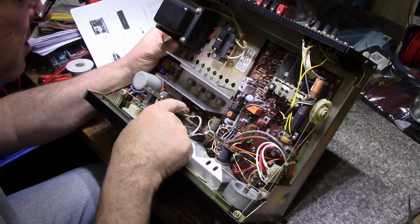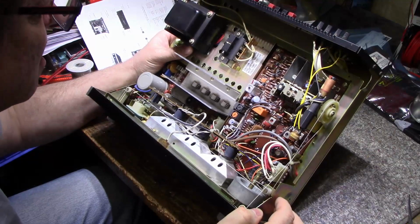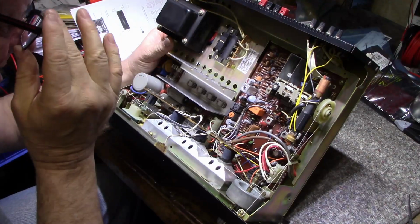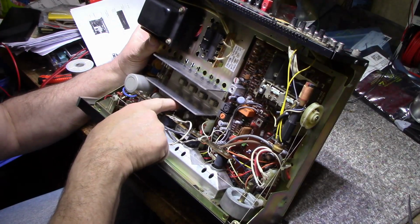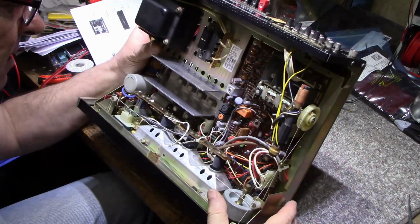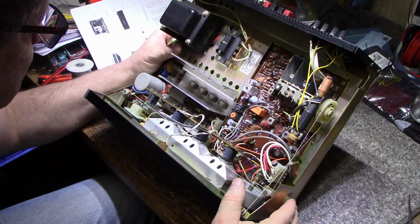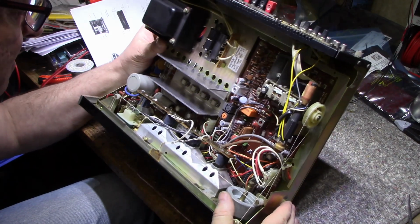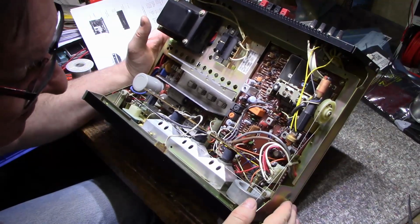Yeah, they got Toshiba chips in there. Toshiba transistors. There's two integrated circuits here. It looks like they're drivers for the power amplifier. You got your power amplifier here with your output transistors, and then there's two chips here that look like they're drivers. I hope those are intact because I'd have a problem finding those. I've never seen those before. Bunch of old caps and Marcon caps. A brand I've seen a lot of because, you know, they fail, I take them out. So everything looks good here.